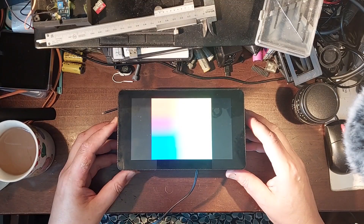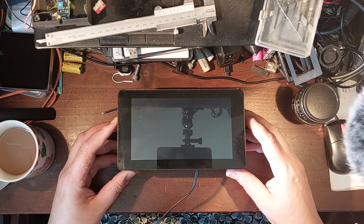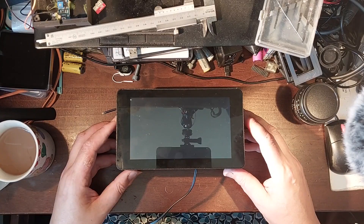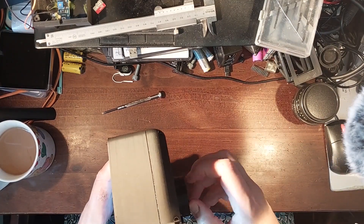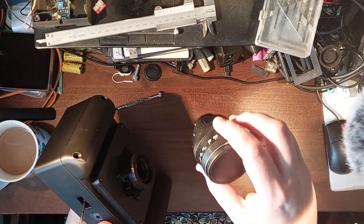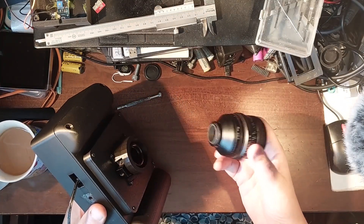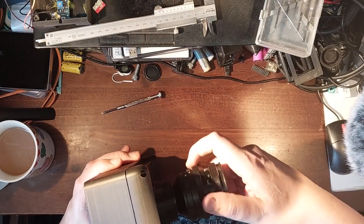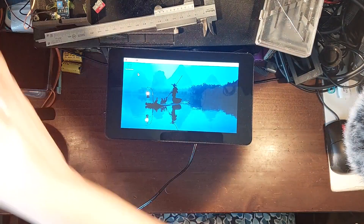You hook up a USB-C power supply and the Raspberry Pi boots into Raspberry Pi OS — which I always stumble over not calling Raspbian. Give it a second and we'll be at the desktop. And there we are. I'm going to pop a lens on the front. I've got an M42 50mm kit lens from a Practica camera on an adapter. It gives ridiculous levels of zoom, but it did allow me to test the thing. If I pull out my Bluetooth keyboard, I can fire up a terminal and open a camera GUI.